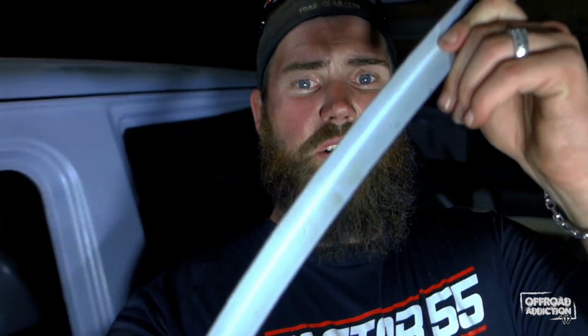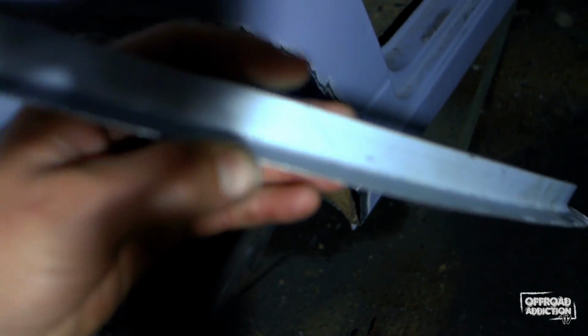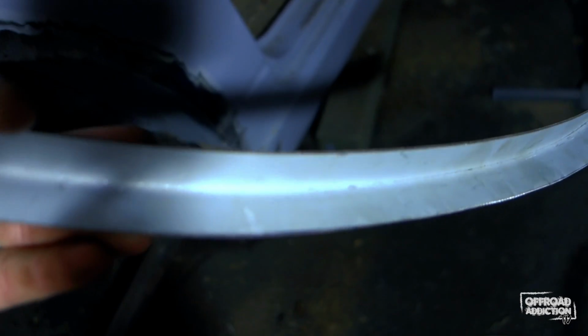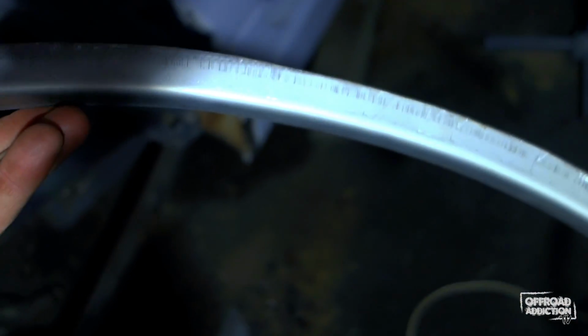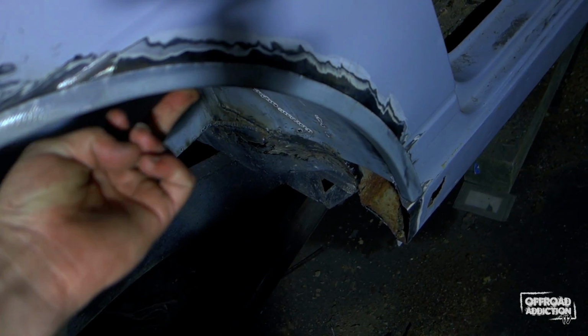through gas like that. Now Gary came around today from PCI Engineering, one of the boys who has been helping me out, and we rolled up some panel steel. He's got the equipment to do so, so we did so. Basically, let me just get out of the way here. What we've done is folded it. He brought his folder down, folded that up, and then he brought a stretcher down, and we stretched it all the way around. So that's going to go on the outside like that.